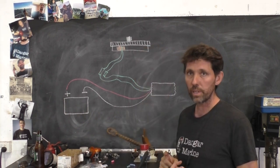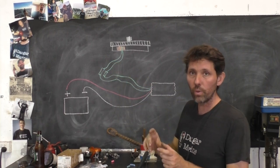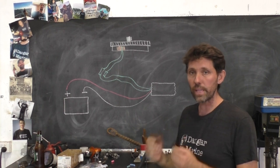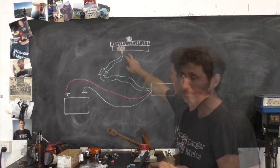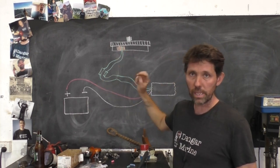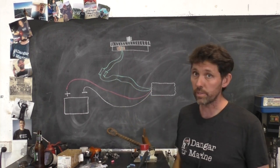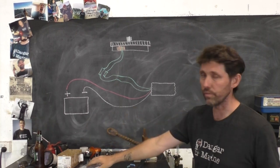One really important thing the boat has to have is a lighting coil under the flywheel. This is a coil that, as the magnets in the flywheel pass the coil, they induce an AC current in the coil, and that's what this regulator rectifier is going to convert to DC so we can charge the battery. On Yamahas, two green wires coming out from the flywheel basically tells you you've got one of these lighting coils installed already. This motor did — I didn't have to put it in, so I think it's pretty standard to have it, not necessarily to have this regulator though.